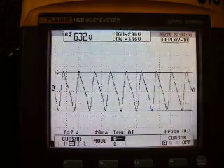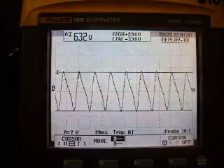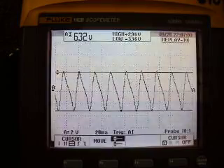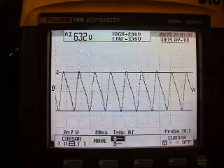If we put our digital meter on here we'd only read half of it, because the digital multimeter is going to divide it in half. That also holds true for Hall effects — if it's a five-volt reference being turned on and off, a true RMS meter will display that at two and a half volts. So if you're doing a quick check on a Hall effect and you're getting two and a half volts, it should be a pretty good sensor.